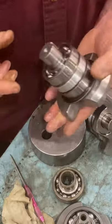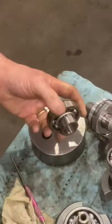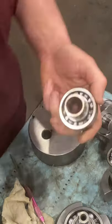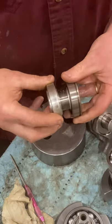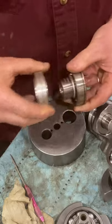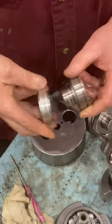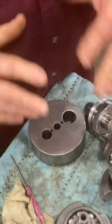What happens is the crank is turning and the seal collar and the inner race are rubbing — they'll actually weld themselves to each other. In this case I pulled the labyrinth seal off — I was able to break it free — and you can see how it fusion-welded itself on up tight. That's why it's crucial to center the seal properly.